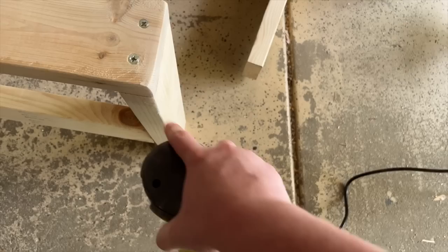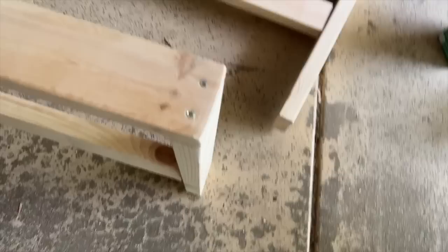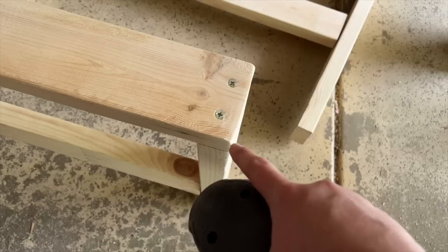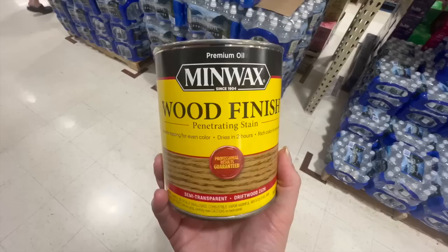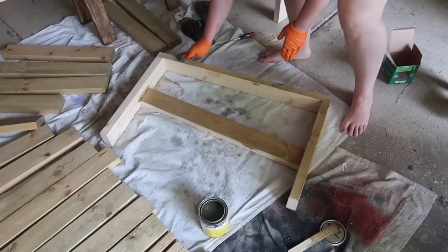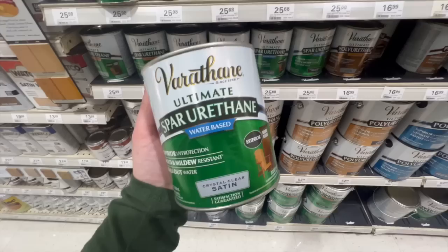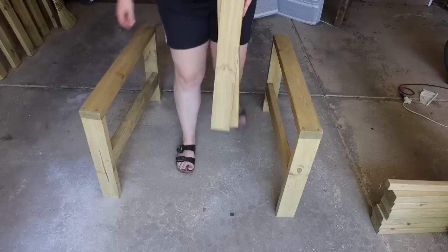On the top corners I'm curving my wrist with the sander to create a more rounded corner — because bumping into a rounded corner is a lot safer than a sharp squared edge, especially with a toddler running around. For the finish I wanted something beachy, so I went with a stain called Driftwood, which let me get into all the nooks and crannies before full assembly. After the stain dried I applied two coats of spar urethane from Varathane, which is made for outdoor furniture — and this is how I got around not needing pressure treated wood.